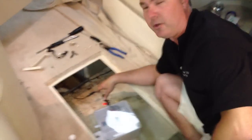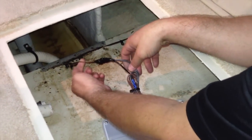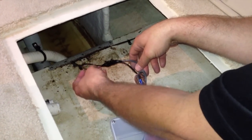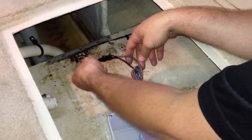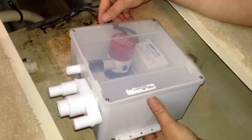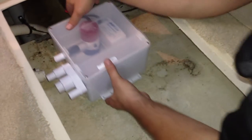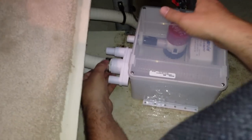I've got the electrical connections made — pretty simple. You take your positive connection, which is labeled, to your positive side. On your boat the color may vary; on this one it's brown with black. Black is pretty universally going to be your ground. The way to test this is just turn it upside down because the float will go to the top. And we know it's working. So now we can go through and set up our hoses.